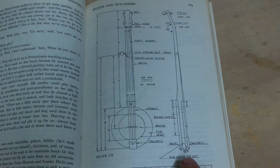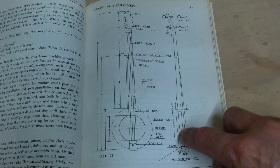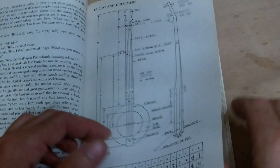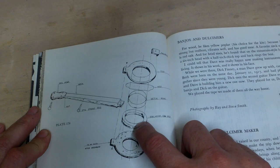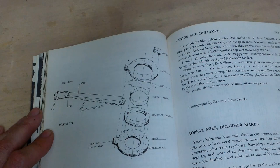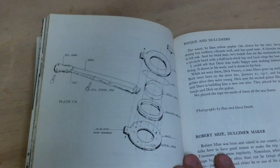The really the only difference in my banjos is I don't include this middle wooden ring in the body. I only use two pieces of wood instead of three. Here you can see there's this inner rim, and instead of that I'm actually just routering out a channel in the top plate so it serves the same function but uses a little bit less material. It's easier for me to do as a kit.